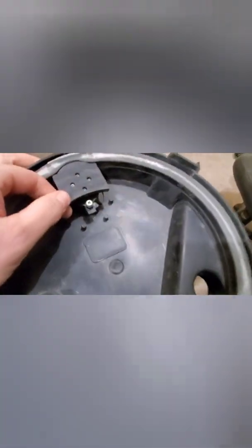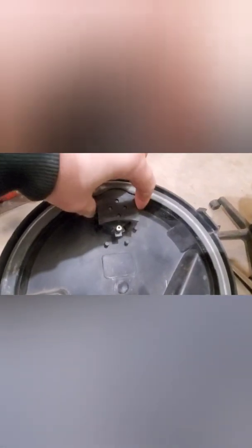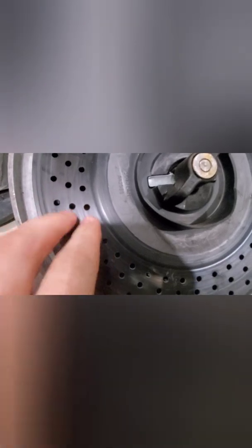There's a plunger here and as you activate electricity, this plunger comes out and stops the vacuum, which causes the seed to fall off the plate so it doesn't plant. There's also a little spring-loaded piece — basically it pushes extra seeds off of the plate, so if any beans get stuck in these holes, as that little spring comes around and pushes on it, it'll pop them back out.